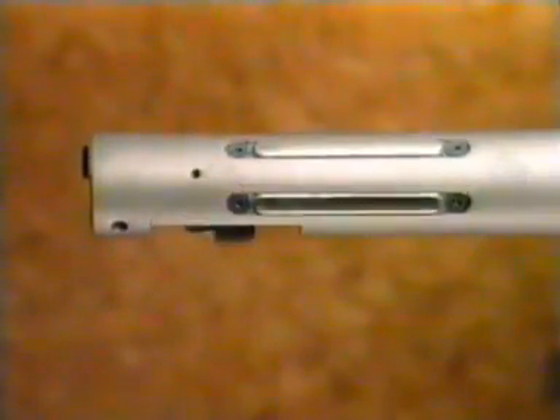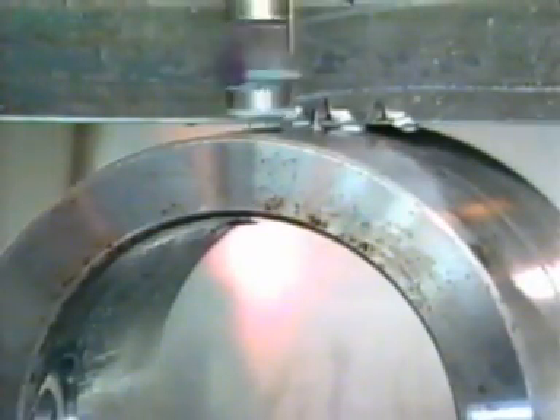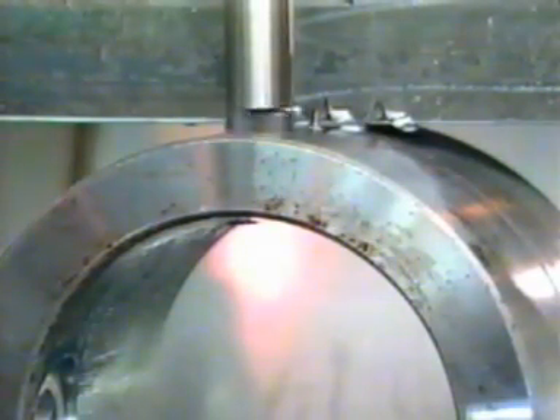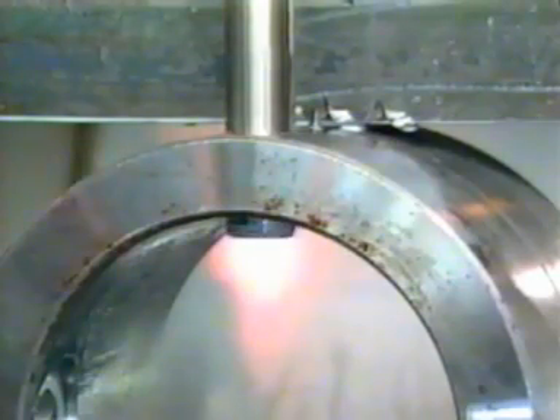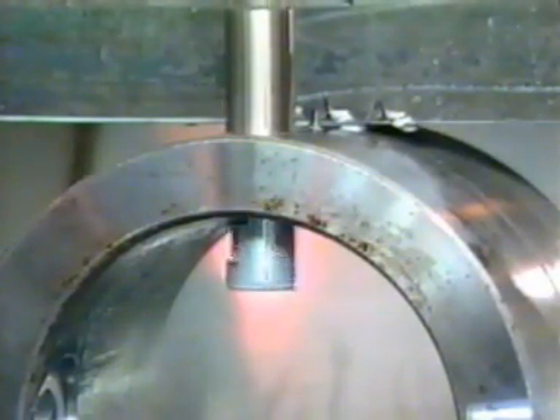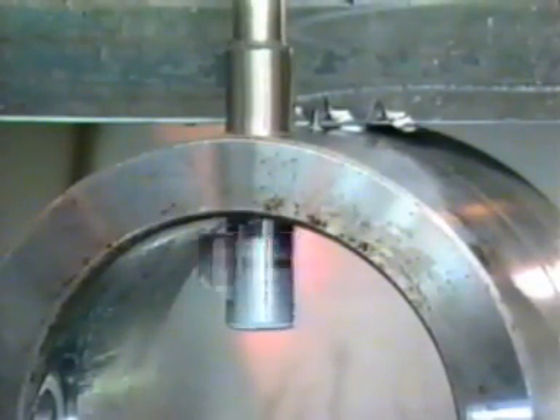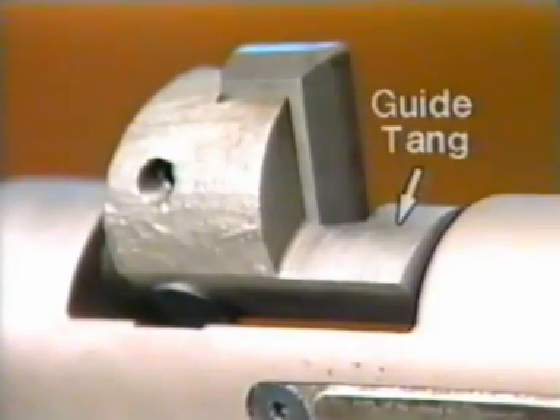The Erex features a spindle and wing with a replaceable cutter that folds into the spindle recess when entering a hole. The spindle, rotating counter-clockwise, is fed through the hole. As the wing touches the rim of the hole, it folds into the spindle recess for clearance. After the wing passes completely through the hole, it swings free again by centrifugal force to assume a cutting position. With tools over 30 millimeters in diameter that operate at lower RPM, the wing is held in cutting position by the guide tang, integrally cast in the wing.